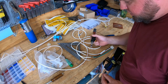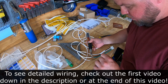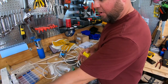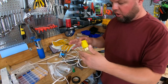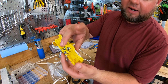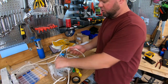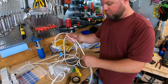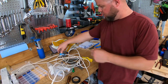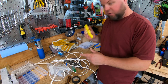Now that all these wires are twisted together, I'm going to solder them up and cover them. I have both wiring harnesses hooked up now with my wires labeled — it's all color-coded. I bought one of these plugs to make my own extension cord basically. It's got a gold side for hot, standard silver for neutral, and your ground on the bottom. Both the hot, ground, and neutral wires coming from the ice makers hook up to this, and then there are two wires left that go to both water solenoids to kick them on and off to send water up to the ice makers.